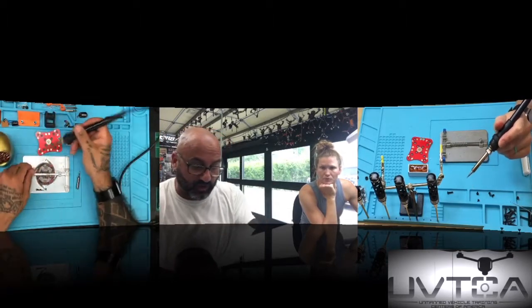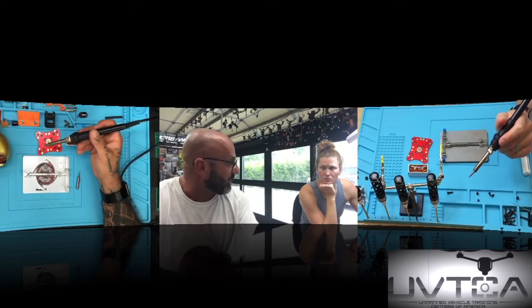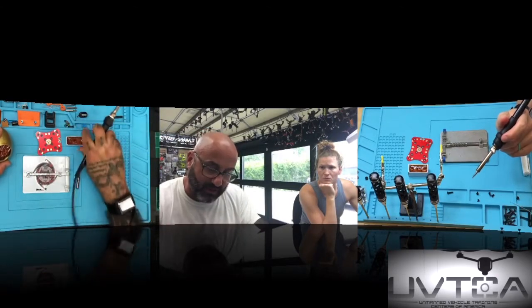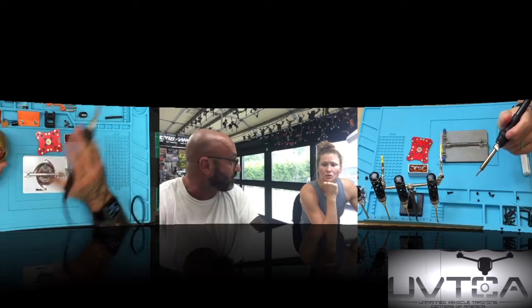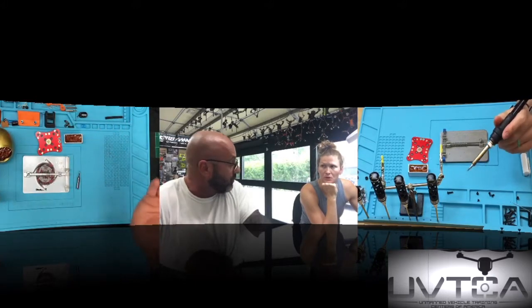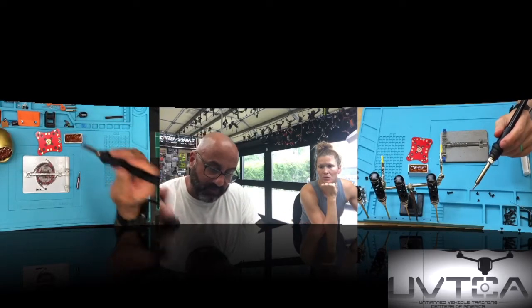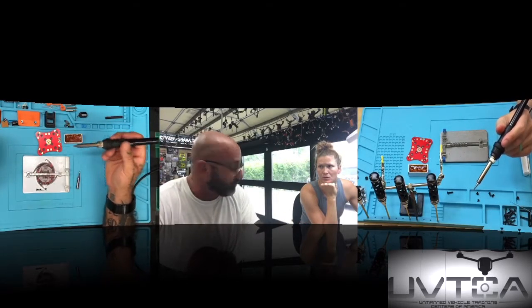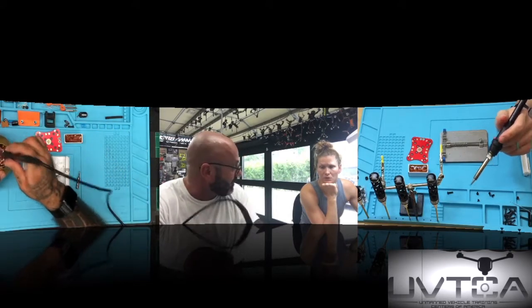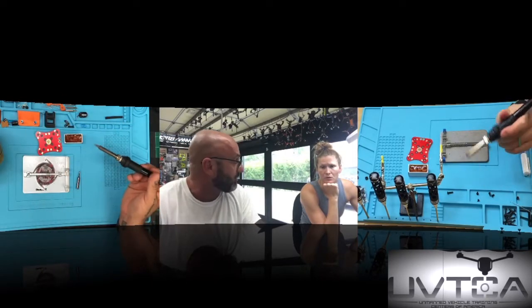You're then gonna take your solder and start soldering. What you'll notice is when you get buildup on the solder, like extra solder on here, immediately just go over here, a couple taps, go back. You're not gonna really touch this again until you're done. Once you rest your solder, let's say you're gonna take a break, we're not gonna turn the soldering machine off, because you don't wanna just turn it off and on and off and on. But when you're resting for 5 minutes or you're gonna do something else, you're gonna dip this in here again to start the cleaning process, go back in here, and then your soldering iron is clean and you can put it back in the holster and come back and solder in a little bit.